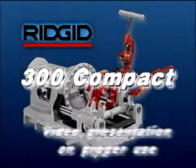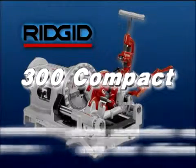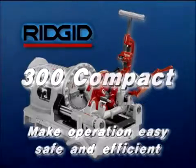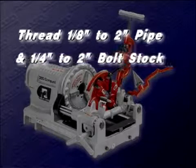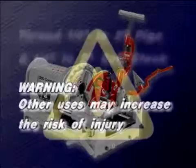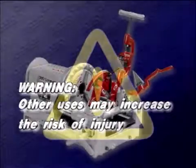The following is a video presentation of your operator's manual designed to make the operation of your 300 compact easy, safe, and efficient. The Ridgid 300 compact threading machine is designed to thread 1/8 inch to 2 inch pipe and 1/4 inch to 2 inch bolt stock. Warning: other uses may increase the risk of injury.